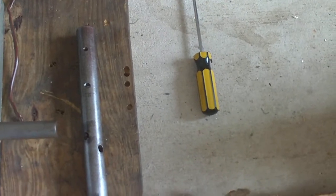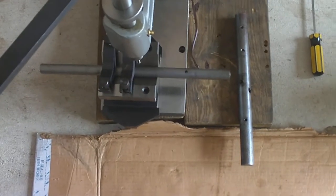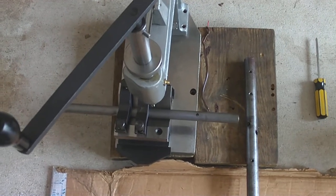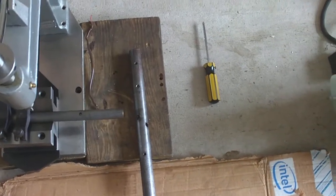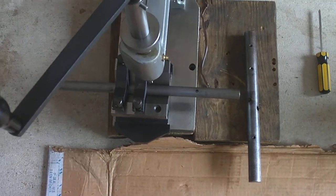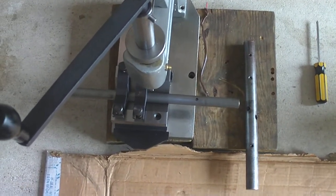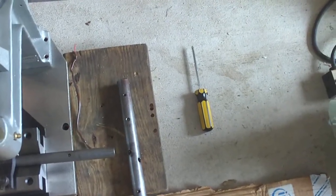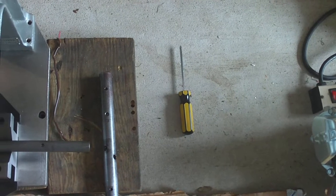I'm going to go ahead and tap that a little bit later, but right now I'm finishing up. You can see I got one jack shaft sitting in there. I'm going to tap that hole — I think it's going to be fine, because I just tapped the exact same hole for the bearing on the large jack shaft. By the way, I already checked to see if the bearing with the set screw would fit into the large jack shaft with that hole I just tapped on the end, and it worked great.